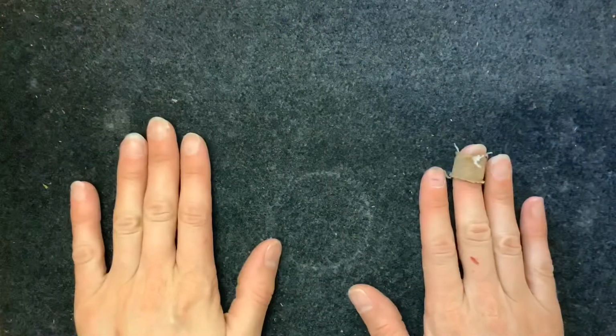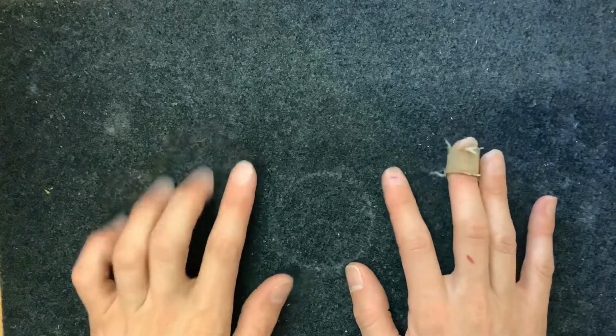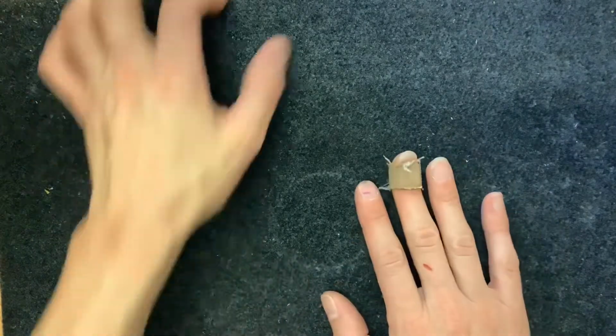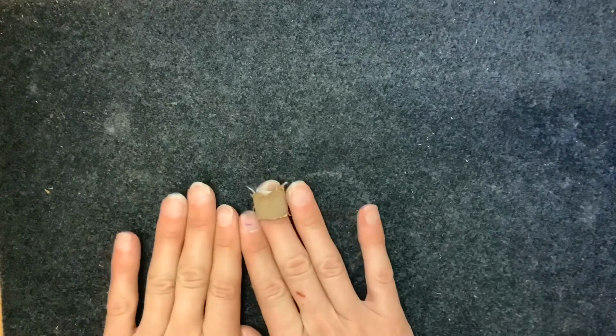They are just a wooden board and they've got this bit of matting on top, okay? And it might be something like a carpet, or in this case, I think it's pinboard material. And you just want to have that, because it's a nice and soft surface, it's not going to scratch your glass. It's got a tiny amount of give, but not too much give. And that's important, okay? We don't want too much give underneath it. We want just enough that it's going to have a little bit of movement, but not so much that you crack the glass just by pushing down on it, okay?